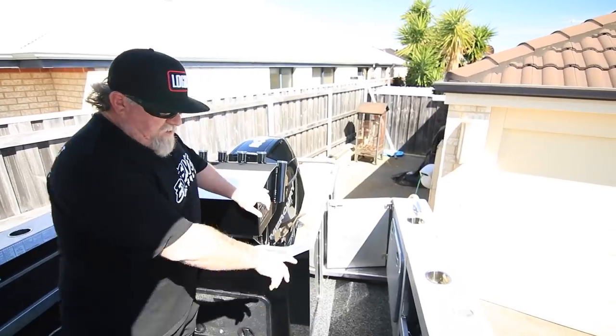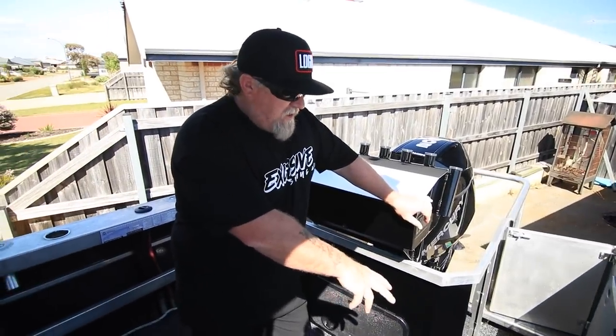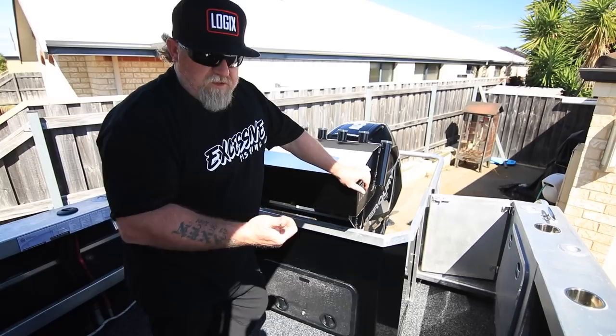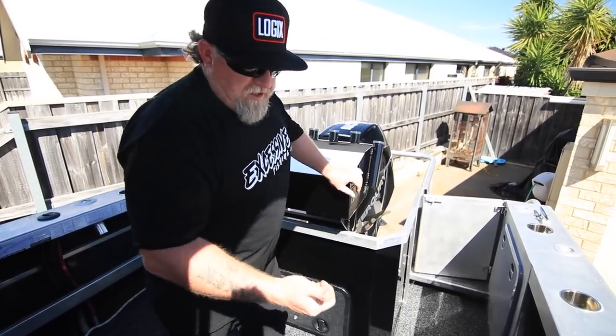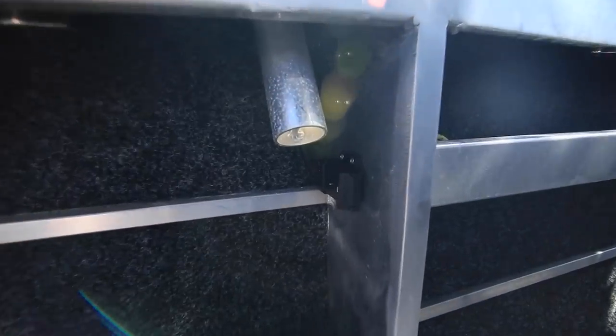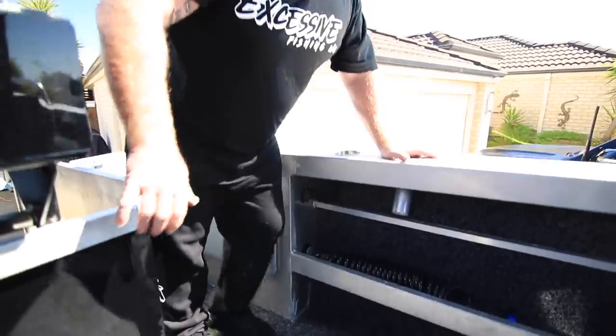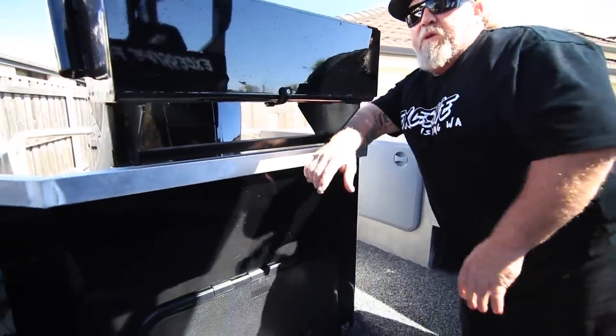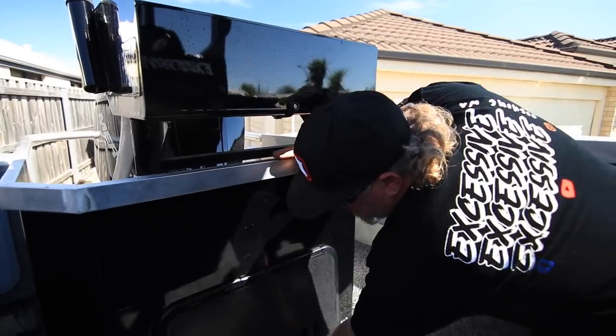We've got deck wash. We're running a deck wash at the back as well. Sorry, so we're not finished, we'll keep going. We're running a high powered deck wash under the gunnel there. We've got 4 deep drop Henderson plugs. So if you have a look under here, we've got 4 electric reel Henderson plugs down the side, all down this side. We're running 2 batteries. So we're just running 1 house battery, 1 crank battery.